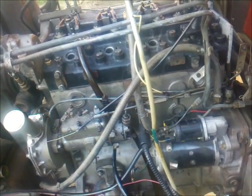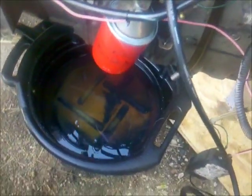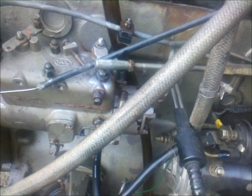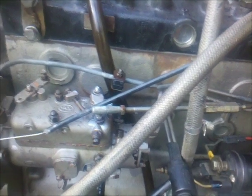After that, I will run the injection pump. I have my oil container here and I will wash out the outputs of the injection pump to avoid getting any debris into my nozzles. Then I will bleed the fuel system on the low pressure side, connect the high pressure hoses, put in the nozzles, and bleed the high pressure side. Then the engine should fire up — that's the plan.